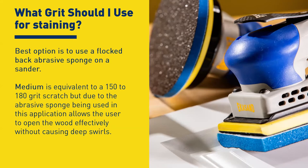We started working with the flock back foam on molding and found it did open up the grain and allowed the stain to take. Not everyone agrees it will open it up, but it does give the best chance, reduces the amount of abrasives used in the shop, and also gives us no swirls — it's a little bit harder to swirl with foam. If you go to a coated abrasive, start around 220 grit with a very light sand — no more than one trip around the rails and stiles, hitting the center panel. The more time you spend, the more chance you have of getting swirl marks.